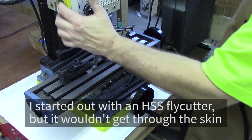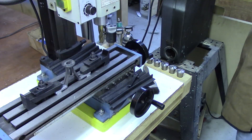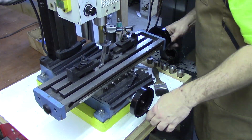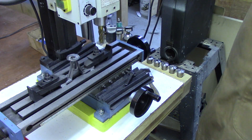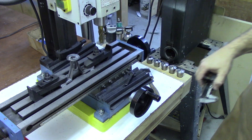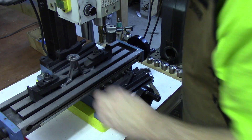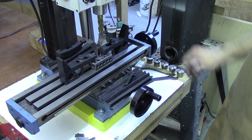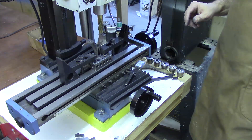Trying this again with a 5/8 inch end mill. That's got it down to within about five thousandths of where I want it, and the rest I'll take off while sanding it down to get a smooth finish. We're ready to mill the bottom sides of the standard. The first bit will take off the extra bits of sprue, and we've got about twenty-five thousandths to go after that.